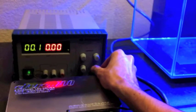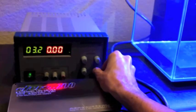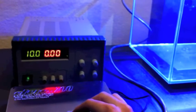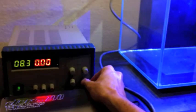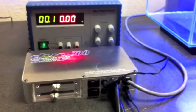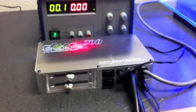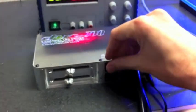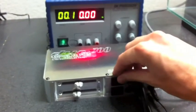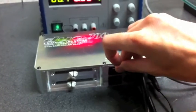So you can see we're at essentially 0 volts. I'm going to increase it back up to 10 again. I'll turn off the blues altogether so you can see the change — that's 100% on the 50-50s down to essentially 0. You will need to turn the actual power source for the LEDs off, for example on a timer, if you decide to utilize the automated dimming function, because you have to cut power to the LEDs altogether in order to get them to turn off, whether you're using manual or automated dimming.